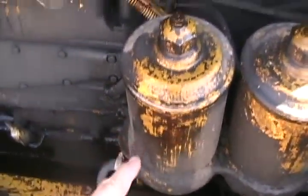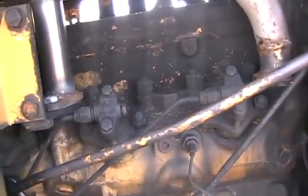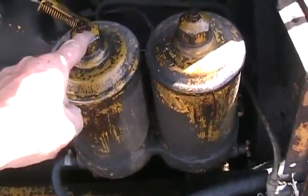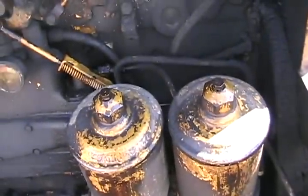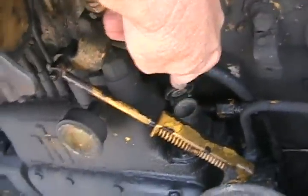That's the fuel tank, and it was out of diesel last time I started it for you guys. Like any diesel machine, when you run out of diesel you've got to bleed and prime the system. Fuel line comes from the fuel tank, goes to cartridge-style filter number one, goes to the second filter, then out to that big old injector pump, which puts high pressure to the injectors. I had to loosen and remove these two little screws on top. Gravity pressure pushes the fuel through — this one bleeds first, then this one bleeds second. As soon as you see no bubbles, tighten them up. There's also a little place to prime the injector pump.